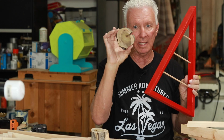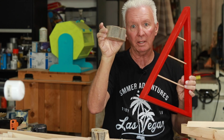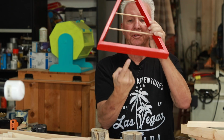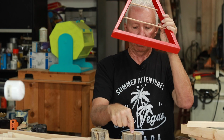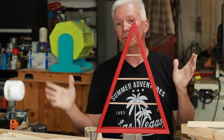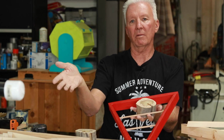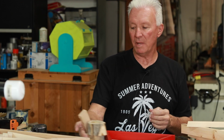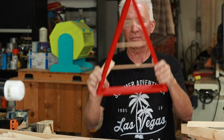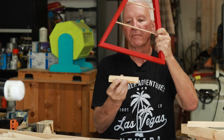It's just the 3.5 to 4 inch diameter branches. I cut them in like 2 inch pucks, like a hockey puck, but 2 inch thick. Simply going to drill a 3/8 dowel hole here, put a 3/8 dowel hole in there and put it together. I don't know if I'm going to glue it. That way I can just lay it in the box, lay that flat, and then pack it away for next year. I think next year I may make a few of these, and on a 5-inch piece of wood, this is what I was thinking of, would be even better than another piece down here.